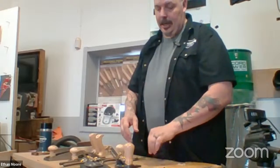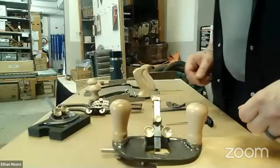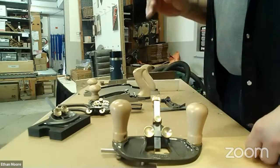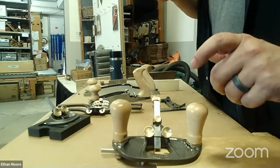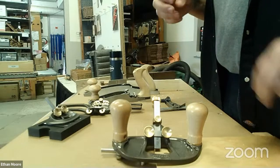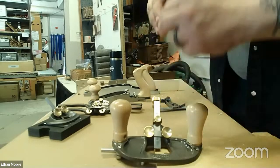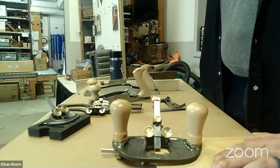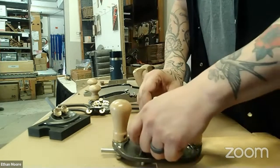Then we have a couple of routers. This doesn't look like a regular router because it doesn't have a universal motor and it doesn't spin at a squazillion RPMs — this is kind of what routers looked like before all of that. You're probably familiar with traditional router planes that have an L-shaped blade. Has anybody ever tried to sharpen one of those? It's a bit of a nuisance, because you can't put it flat on a stone — you have to hang it off the edge of the stone, and there's nothing preventing you from rocking it by accident. Whenever you see a vintage one of those blades, it looks like a dome because it's been sharpened incorrectly.